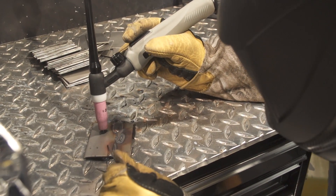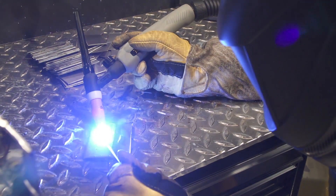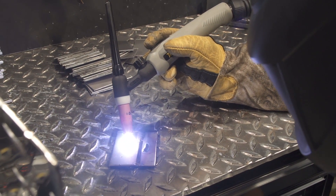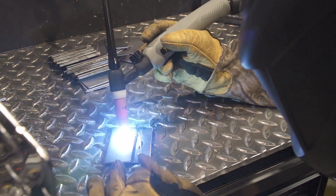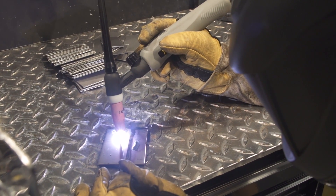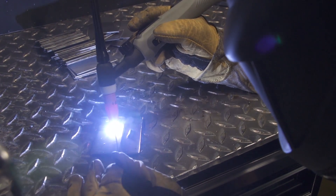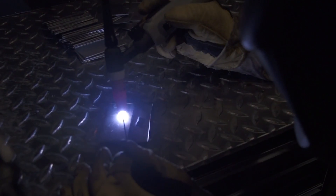Touch to the material, push the button, rock it off — we'll get that small little flashlight arc that lets me move the torch all around the workpiece until I'm exactly where I want to be. Get into a good position, let go of the button, it slopes up, now I have an actual weld puddle to work with, and I can begin welding across my material.